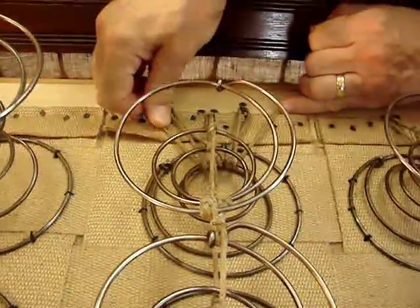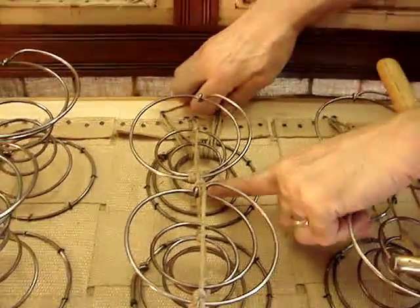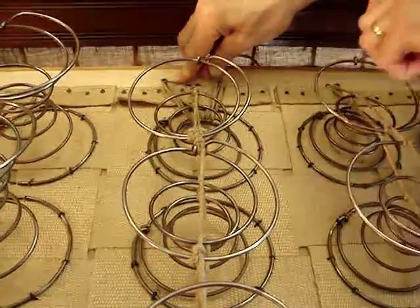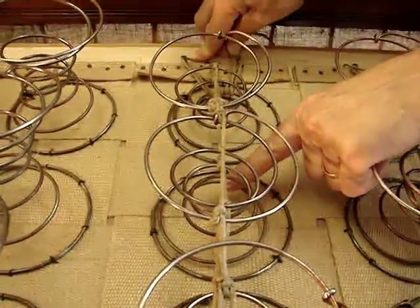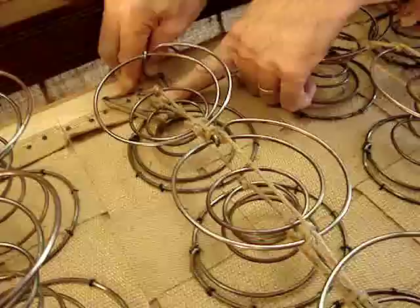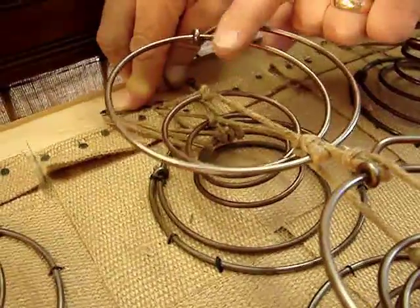Watch what happens when I pull — I can influence the direction the funnel moves. If I overcorrect, I'm actually going in the opposite direction and I want to pull it the other way. Those directions can be corrected by going in the opposite direction with twine or simply tying a course lower down upon the rungs. There is a downside to this method, especially if you're crossing over numerous funnels and not actually anchoring your tie to all of them: as the spring collapses, it can abrade the twine and cause it to break. It can also keep the spring from compressing completely, changing the way the piece sets.